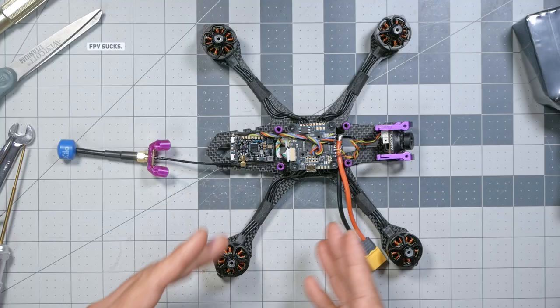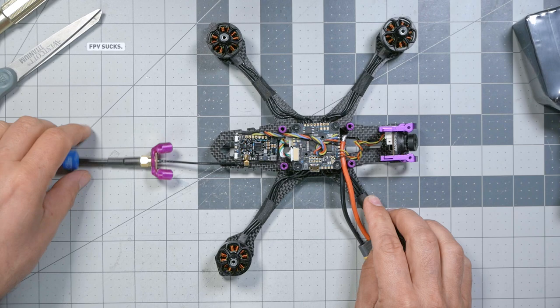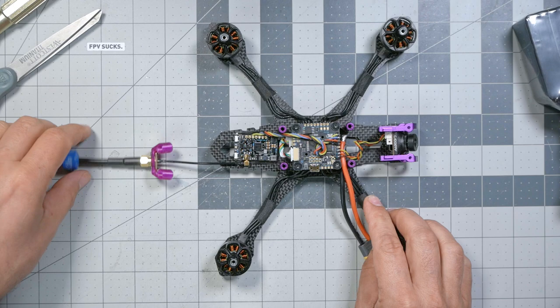Here's where we're at as we come to the end of this video: the video transmitter is installed on double-sided tape, the MMCX to SMA wire is mounted on the antenna bracket, the antenna is installed, the camera is installed, and the camera and video transmitter are wired to the flight controller, which is configured to remotely control the video transmitter. Head to the playlist in the video description for the next video. The next videos in the series cover the Walksnail or O3 video transmitter — feel free to watch those if interested, but if you installed the analog system you can skip them.